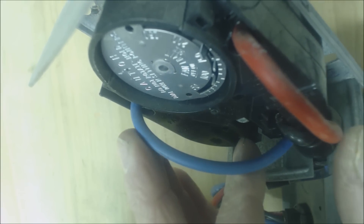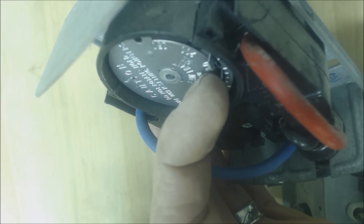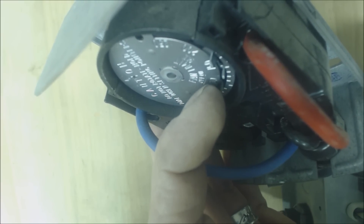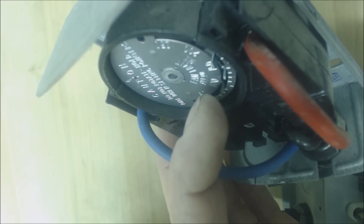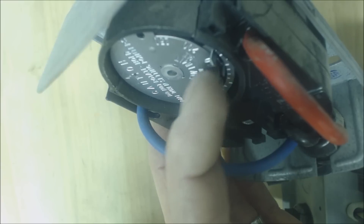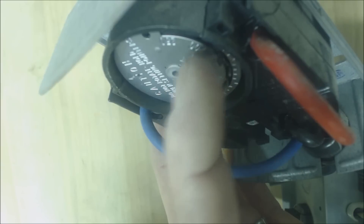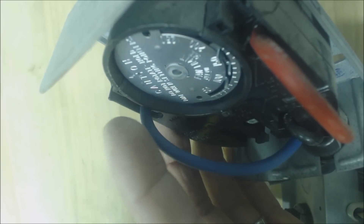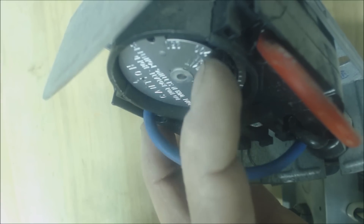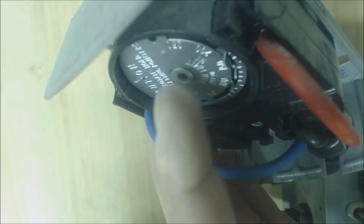It will close these contacts wherever you have this second knob set at. The third knob is the limit and the first knob is actually where it turns off at. Typically you'll have that first knob set at somewhere around 90 degrees, the second knob around 120 degrees, and the third knob around 160 to 170 degrees. The third is just to shut the furnace control voltage off if the blower motor just won't turn on, maybe due to a bad capacitor or something like that.